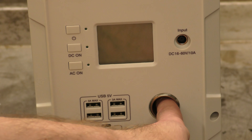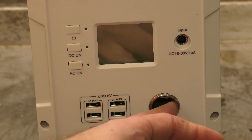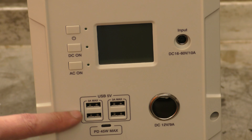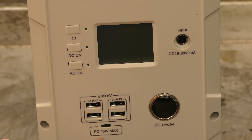We also have a 12-volt cigarette lighter output, though slightly disappointed it's rated at 9 amps — that probably wouldn't start most diesel heaters, because they literally hover at 10 amps and 9 is not enough. We've got our usual USB mix — 3 amps on the USBs. We've got a USB-C, which is a 45 watt, which is kind of old and slow now because the others are charging at 100 plus watts for USB-C.